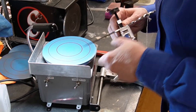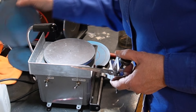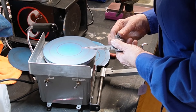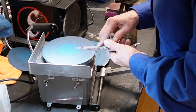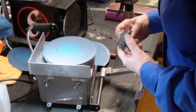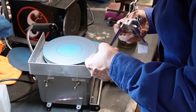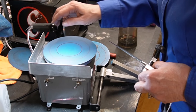This one is really nicked up — it won't slide cut if there's a nick in it. I'm going to have to go back to my slightly coarser grit, the worn 800. I've got the rings visible. With the last person I trained, that's going to be my new way of doing this — worrying about what touches in that center area, because that's my sweet spot on the plate. I still feel that nick. Maybe... I think it's gone. Let's go back to the 2000 to make it look pretty.